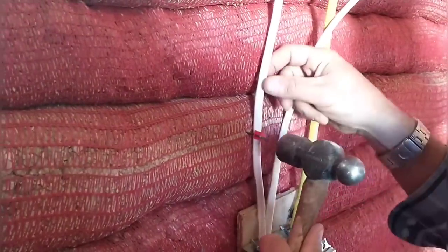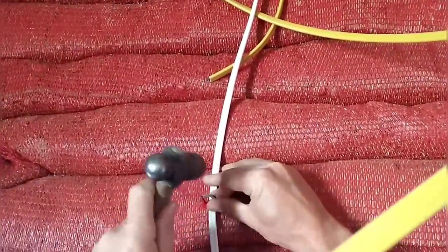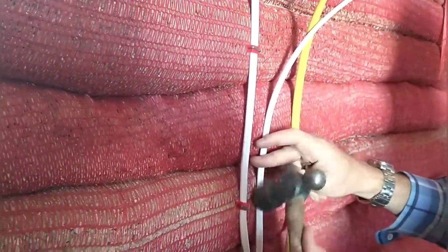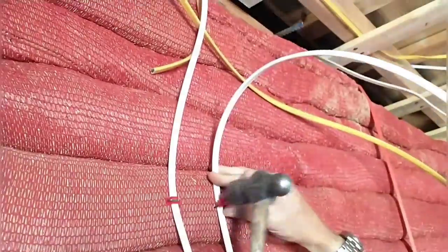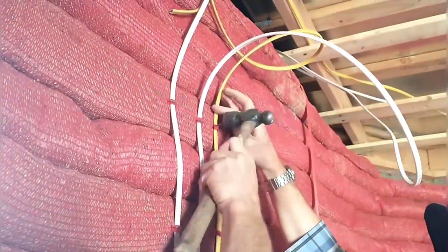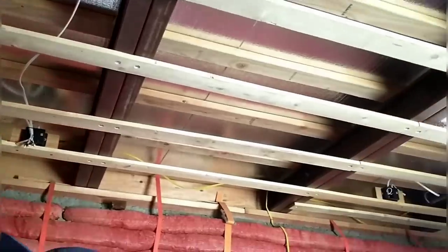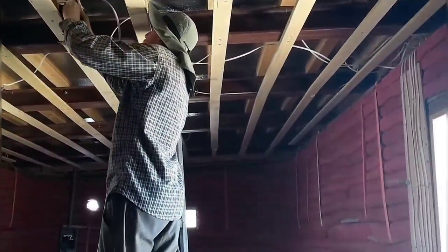Kyle did most of the electrical work and here we are just getting ready to attach the wires to the bags to clean them up and get ready for stucco. Most of the wiring was run in the ceiling, but some did have to go across the bags. We had seen other people use these staples — a long U-shaped nail with a special plastic clip that keeps it from damaging the wire. I wasn't expecting much, but surprisingly they grabbed really well. The earth in these bags is really hard, and there was quite a bit of resistance driving in these nails, but they seemed to grip really well — a better form of attachment than I anticipated.